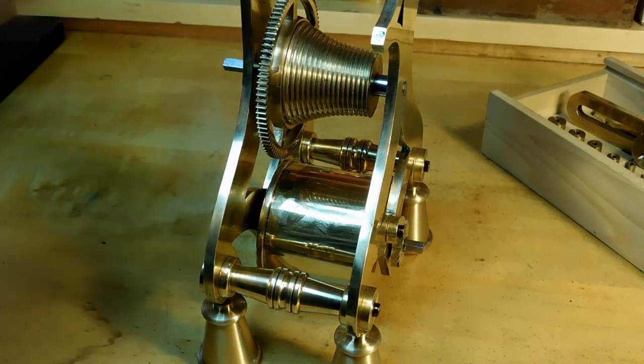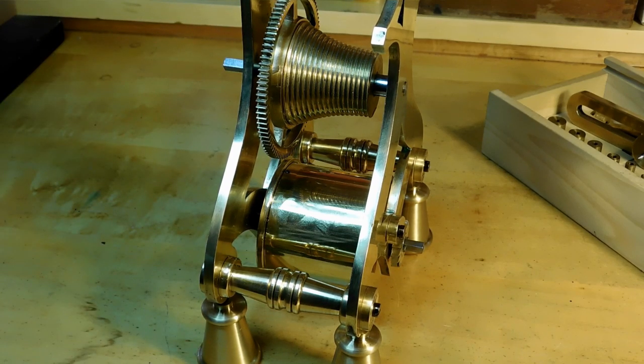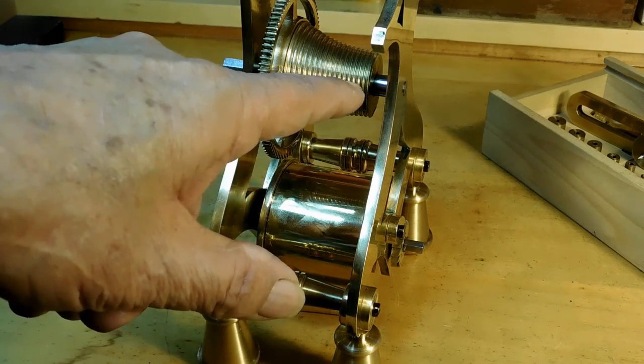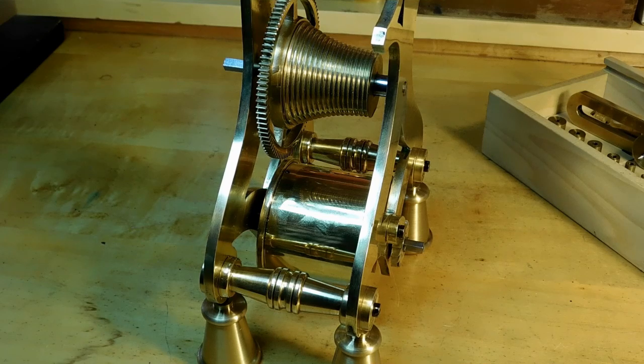This is done with a mathematical formula. When we finish, we're going to put an adjusting bar on there and make a little graph, and we'll adjust the grooves so that the torque of the spring remains constant. We'll also be adding stop works later so that the cable between the main spring and the fusee cannot get to the end — it stops before it could break or fray. But that's done later in the build after we've got the pendulum and the escapement in there.